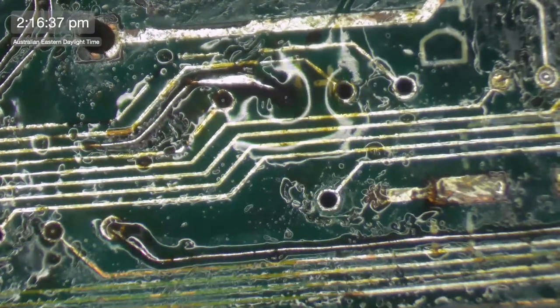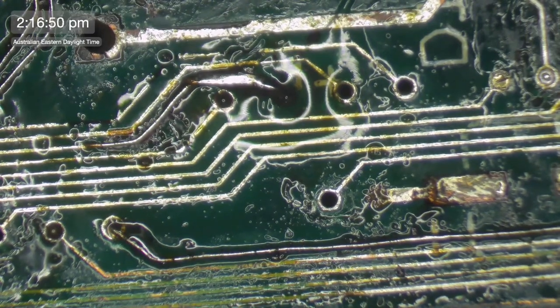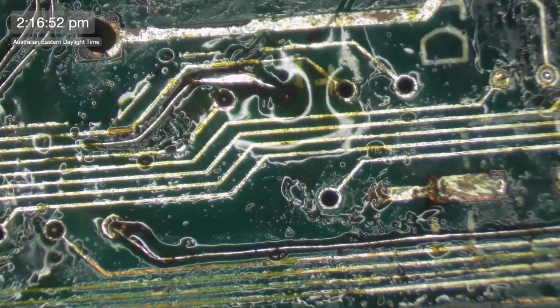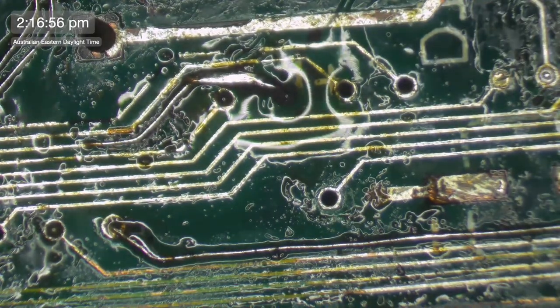That's pin 8. It's nice they're sequential like that, isn't it? So pin 8 needs to go to pin 4 of the video ROM. So 8, pin 4. Yay, that one's still connected. So we're good there. And it goes to pin 1 of that sound chip, which is there.